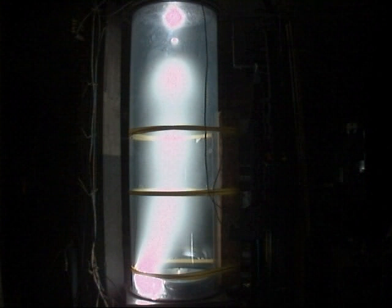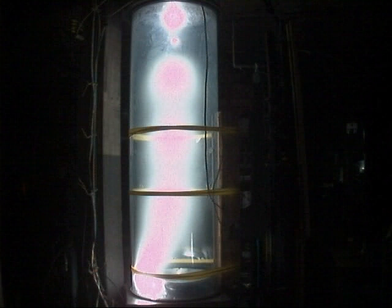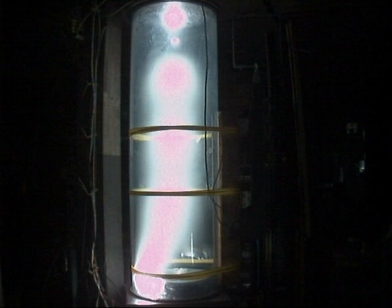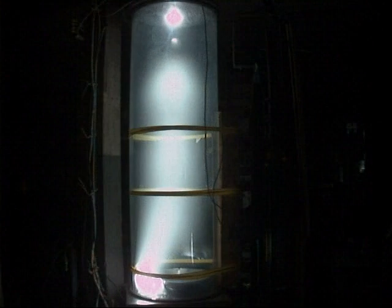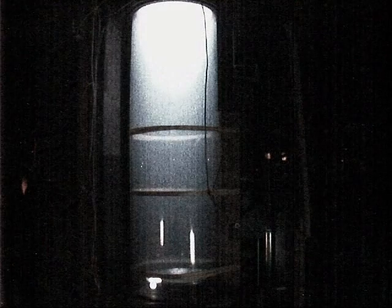I'm going to juice up the power a little. It's holding about 90–95 millitorr. Going to six amps. The balls are delineated. I'm going to see if I can back that off and get those balls back. I lost the ignition. The tube is actually slowing slightly — purplish blue haze, the computer is seeing it as white, but the monitor of the VCR is seeing it accurately. I have to back down. We're definitely burning the oxygen out of this.